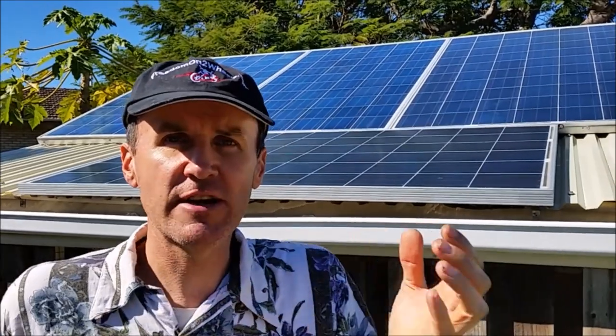Make sure you keep your solar panels clean because it will increase their efficiency. It's winter in Australia and there is dew building up every night on these panels — water condenses and that attracts dust. Especially in winter, when there are big temperature differences, solar panels get dirty more often. Because we haven't had rain here for a long time, you find that in winter you need to clean the solar panels more often than in summer times when there is heavy rainfall.